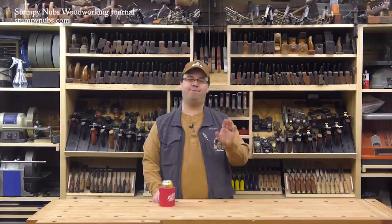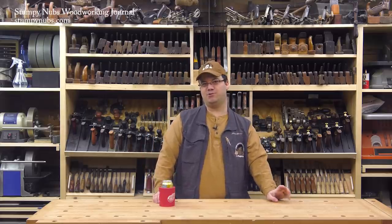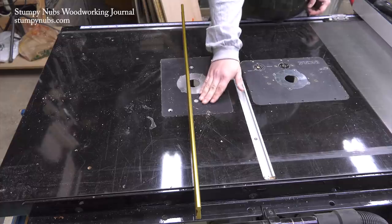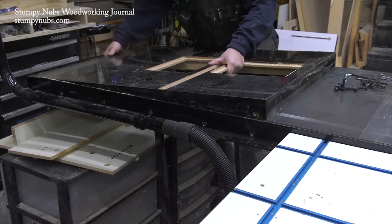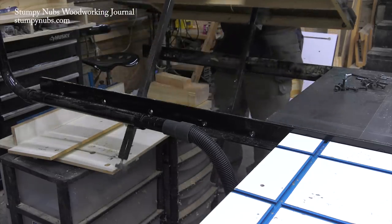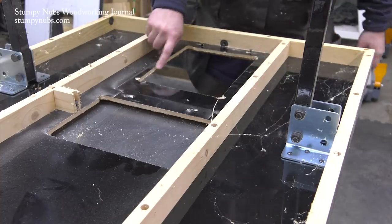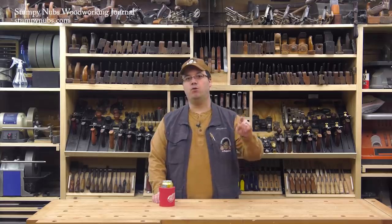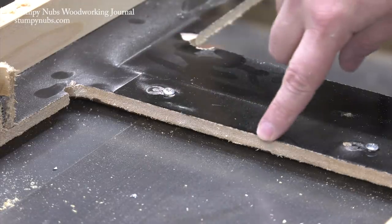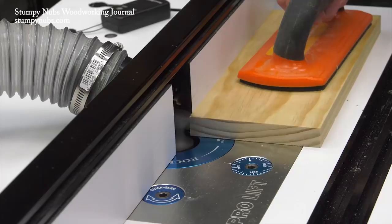The answer is simple: it is sagging faster than your grandma's polyurethane on a vertical surface. My sag problem is due to the sheer weight of the routers and their lifts. The fancy side table that came with my saw may look nice and thick, but it's nothing more than shiny lipstick on an MDF pig. There was a pine framework on the underside which I may have compromised when I hacked out one of the router openings. SawStop really never made that table to support routing equipment — my table is no longer flat and something had to be done.